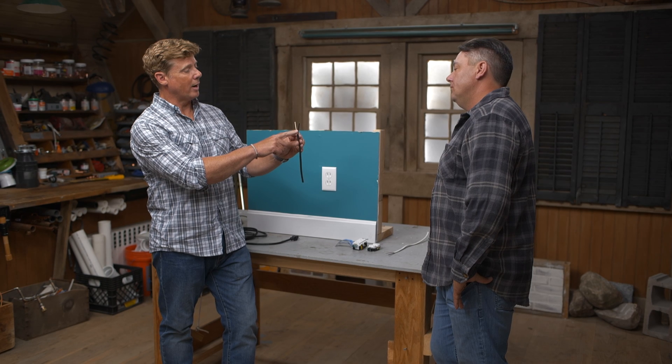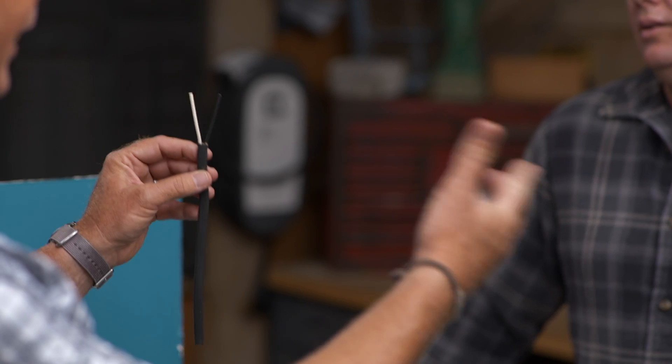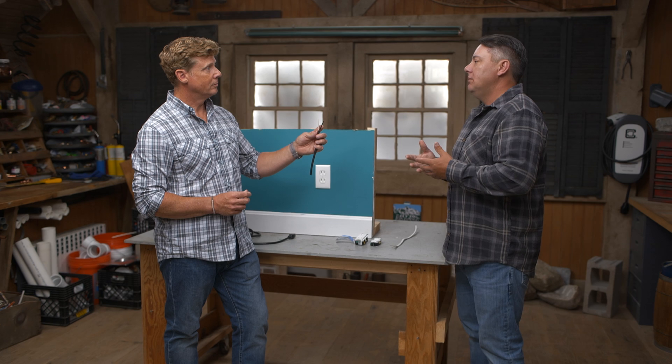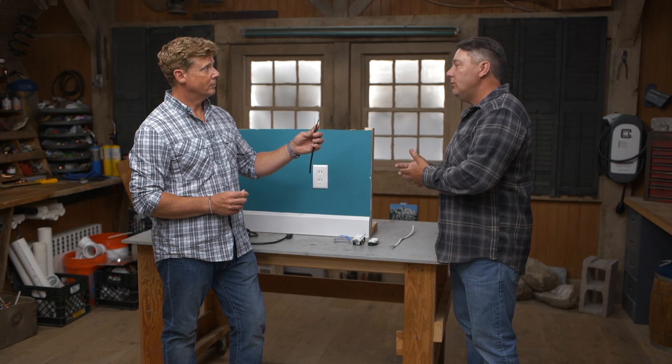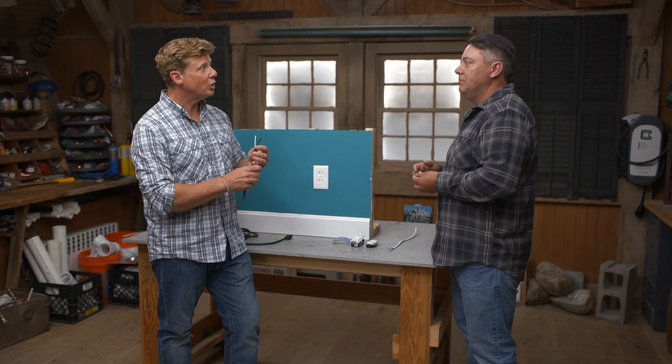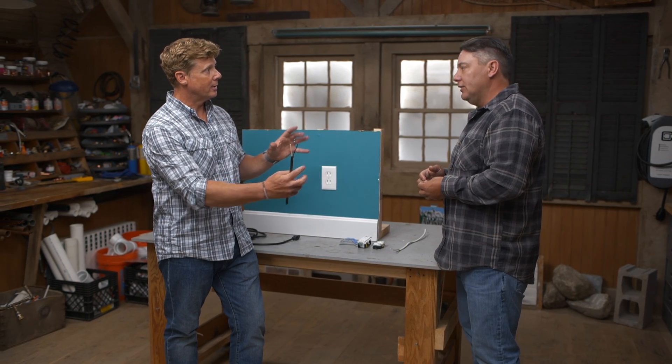Give an example where two-conductor wire could end up having current come out and into whatever it's attached to. When you see this in a home, the wiring is probably older, possibly brittle, and may need inspection. Picture an older washing machine plugged into a two-prong receptacle in a basement. If that black wire wore down over time, rubbed through, and is now touching the metal housing, that metal housing is now energized. But because it's not grounded, there's no way to get the current back out. So it's sitting there energized — someone could simply walk up, touch a water pipe, hit the machine, and they become the path of least resistance. Now you get shocked — it's a real safety issue.